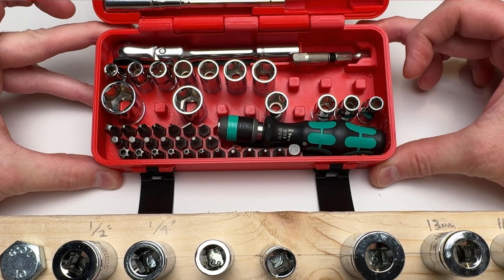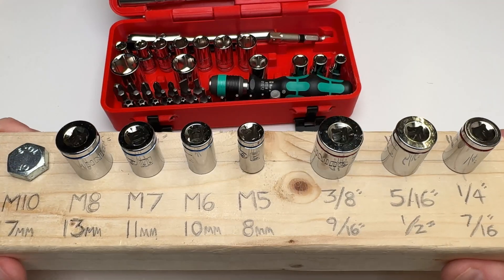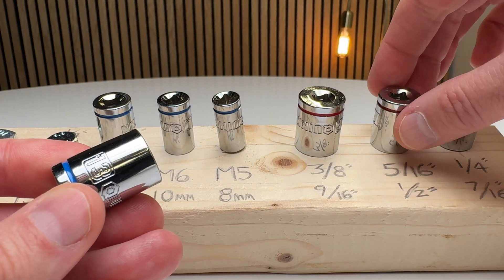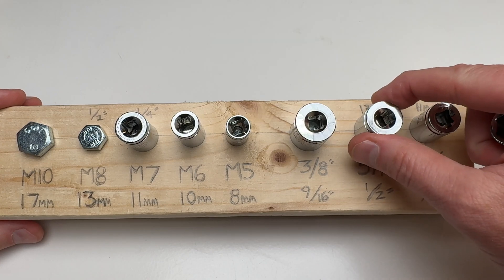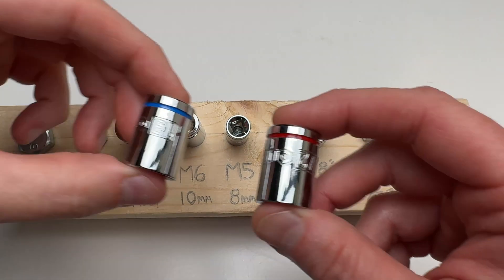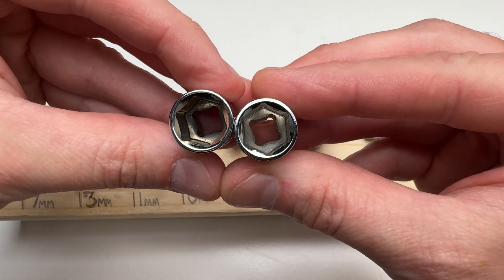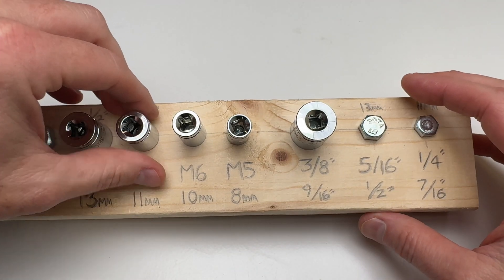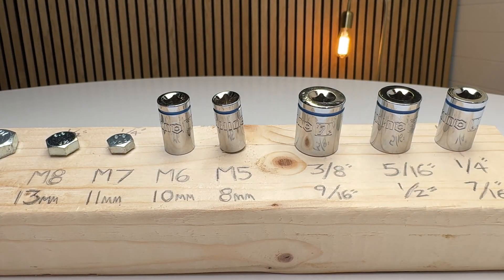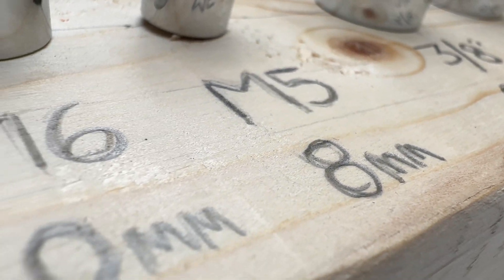All of these other sizes in this kit are really not commonly used, so they're probably not something you need to carry day to day from an EDC perspective. Now we can simplify even more because there's some overlap between imperial and metric sizes. This 13 millimeter metric will work perfectly fine on a 1/2 inch imperial — there's a little more play, but that's fine. However, the reverse is not true: a 1/2 inch imperial socket is just a little too small to fit onto a 13 millimeter. So if you just want to carry one, go with the 13 millimeter metric. The 11 millimeter is also very close in size to the 7/16 — in fact, they're interchangeable, but for simplicity I'd go with the 11 millimeter to stay metric. And this 9/16 inch socket from the imperial side can actually be fully replaced by a 14 millimeter socket. This proves my hunch that if you want to carry one set of sockets that will cover most situations, go with a metric set.